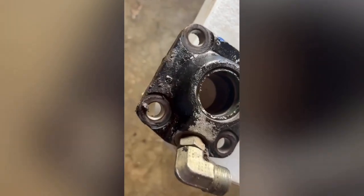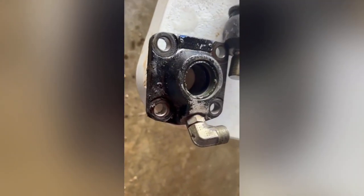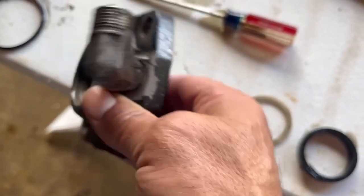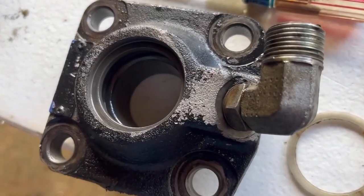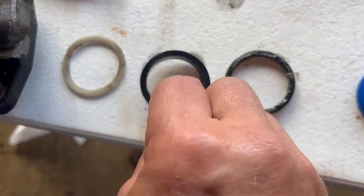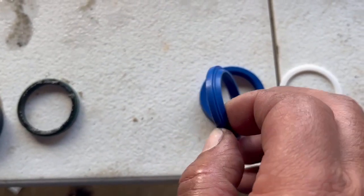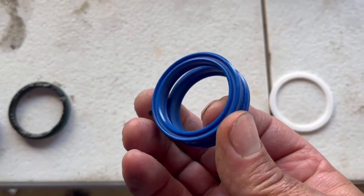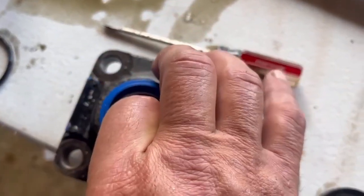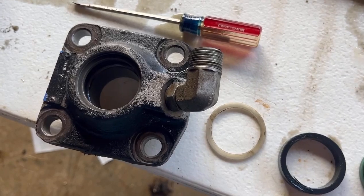Here's the cap. As you can see, there's a series of seals inside and then on the back side there's an O-ring. We're going to take those out and replace them. I've taken the seals out, the O-ring on that side — which I've already put one back in — and then I've taken the seals out of the inside. The way this goes is: this seal is on top, then this seal, and then that white one there. Looking at the new ones, that one goes on top of this one, and this one is cupped on the bottom, and then that sits on top of it like that. So those three will go inside up here, and we'll get those installed. Then we'll do the same on the cap that's still on the tractor.